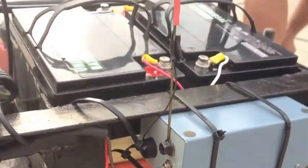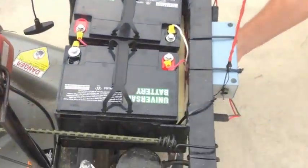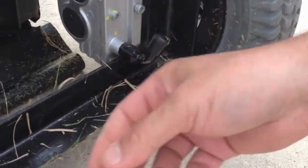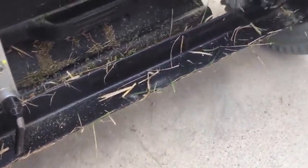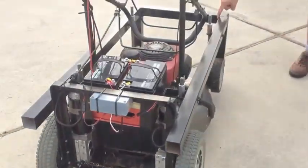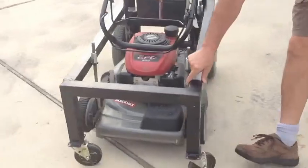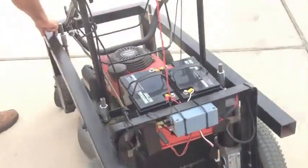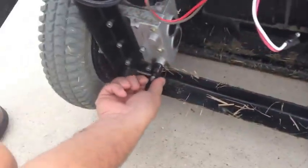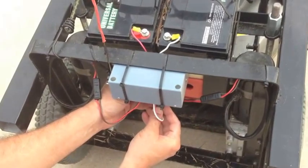As far as the smoothness of the system — these two latches control engaging or releasing the wheels. Right now it is in release mode, so I can move it with just one finger, easily left and right. We are actually on a slope, so that's how well this cart works. When we want to drive it, we engage the gears by rotating this one and rotating the other one back. Once engaged, we can plug in and go.